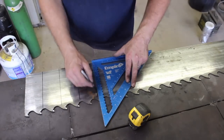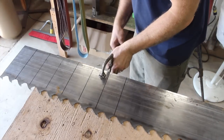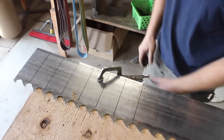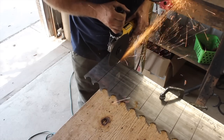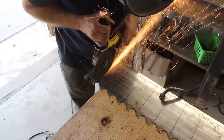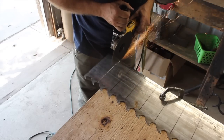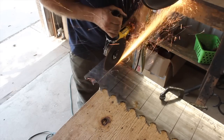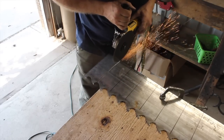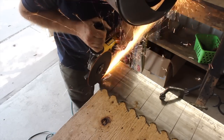As you can see, I'm marking off some sawmill blade to cut up into pieces. I'll be using that for the pattern-welded steel, or Damascus steel, for the blade and pairing that with 1095 high carbon steel. 1095 and 15N20 — which is what the sawmill blade is — is my favorite combination so far for Damascus steel. There are other good ones too, but I've gotten some really good results with this.